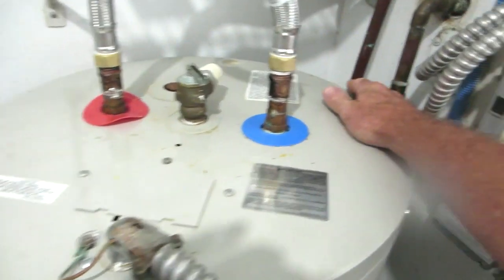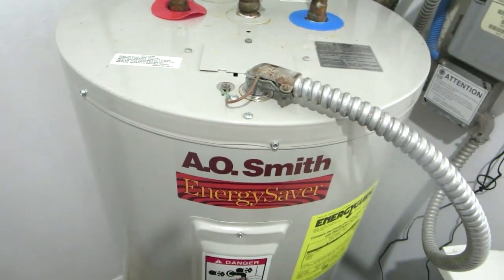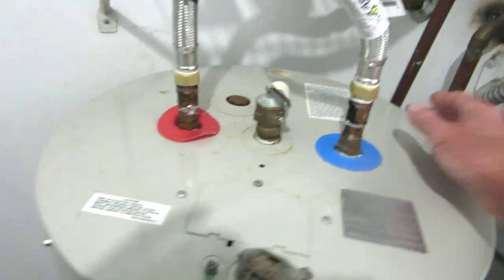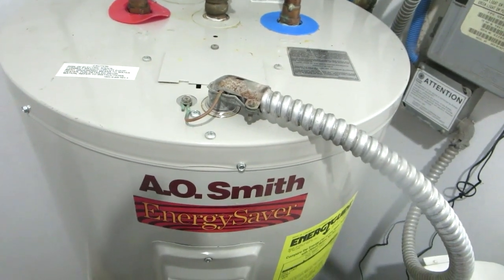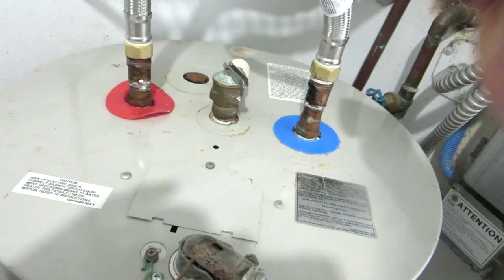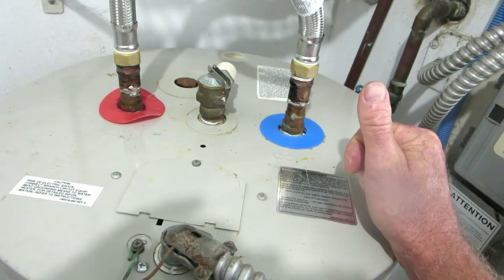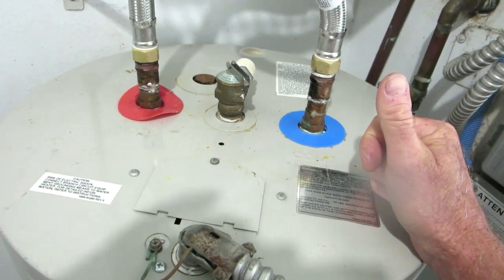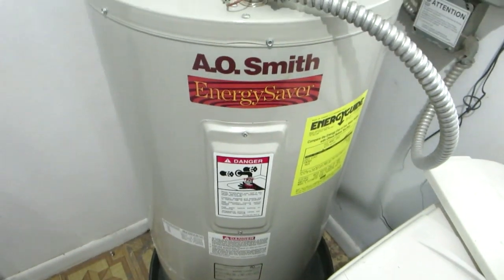Water stays off while you do that. Once you squirt it back up in there, you turn the water off and see what comes out of that hose - in my case it started trickling out pretty good. Then come back in and turn the water back on. If it's clear, it'll blow all that calcium crap right out. If it doesn't do it at first, give it a couple of tries. Every time you're blowing it back into the water heater, make sure the water is off and the kitchen faucet is turned on hot. Once it starts going, turn the kitchen faucet back off so all the water pressure is going into the water heater and blowing out the bottom.